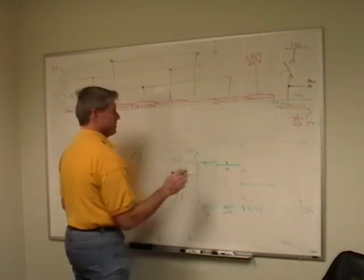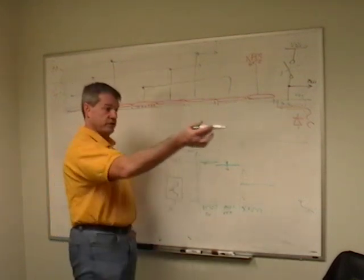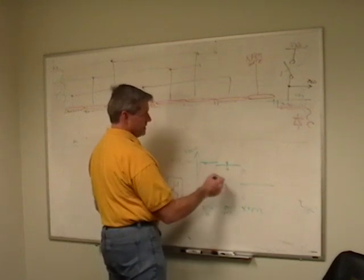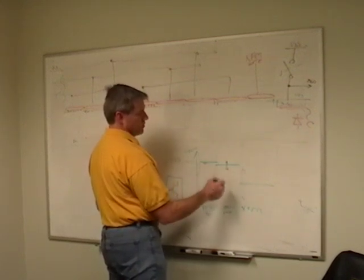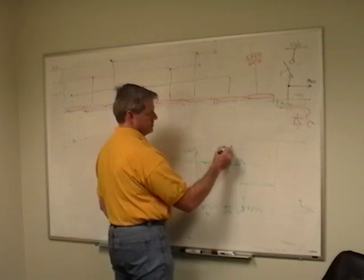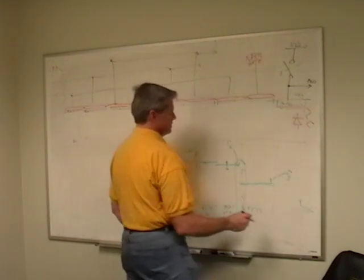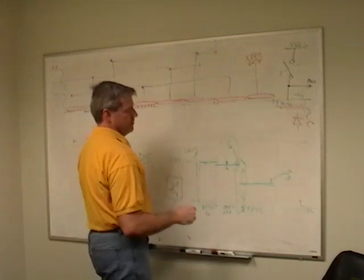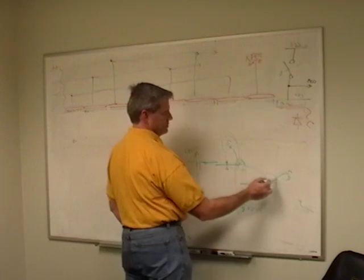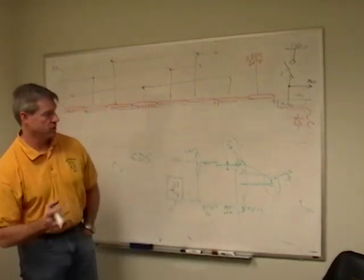So if I'm going to take this out into the world and digitize it for my video camera to put on YouTube, where I guess you're watching this, when I do my reset, before I do the transfer, at this time right here, I can sample this. So I do a sample here, and then when this comes in, I do a sample here. So I take two samples. The first sample was of my reset noise. The second was of this, and I can subtract the two and say this really should have been up here instead of where it was because I got some losses. And so correlated double sampling does that.